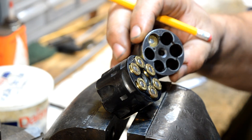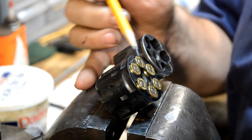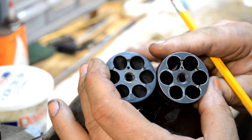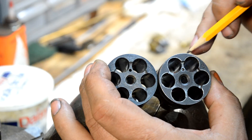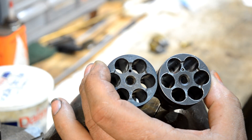The next thing we have to do is unscrew this. I'll tell you, it's loose because I took it apart before — I'm not going to embarrass myself. So we note a few things: flat sides, undamaged as yet. There's a hole here that the piece has to go into, and it's broken off. That hole will have to be drilled out, and the piece that we need to get rid of is down inside this hole. We're just going to pray that piece is nice and soft so we'll be able to bore that out.